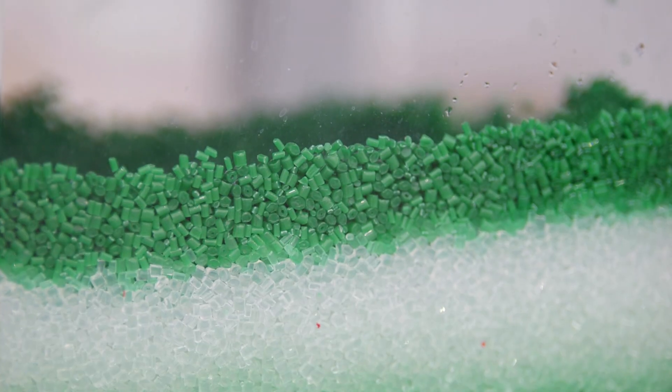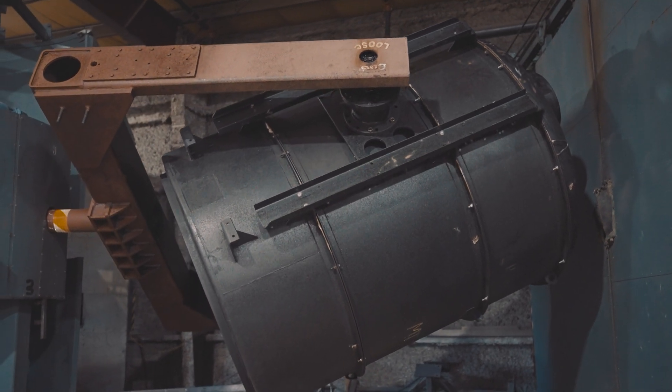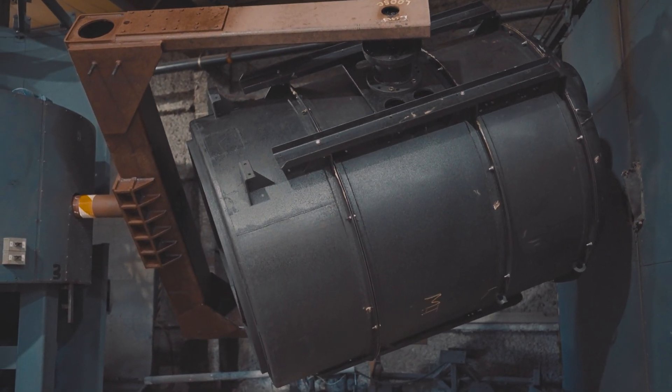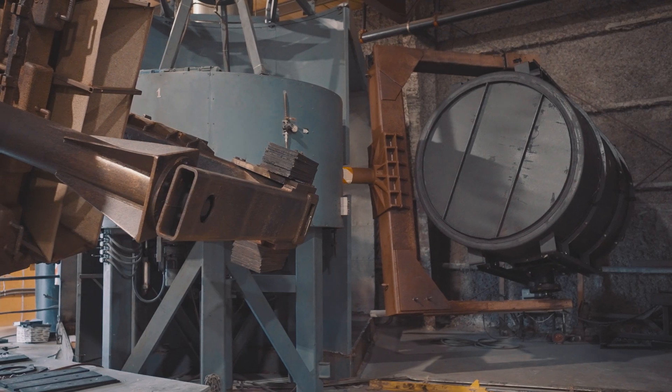So how does rotational molding work? First, plastic pellets that are typically used for all sorts of plastic manufacturing, like injection molding, are grinded down into a very fine, consistent powder. This plastic powder is then put into the rotational molding mold. These molds are generally going to be a lot bigger than what you would normally see with injection molding because the products are so large. This is a low pressure system, which means it doesn't require a high amount of force like injection molding — it simply works on properties like gravity and rotational force to mix that solution around in the mold.